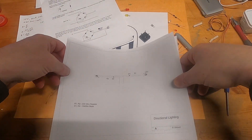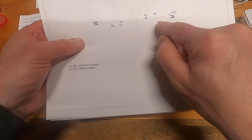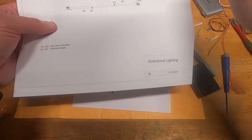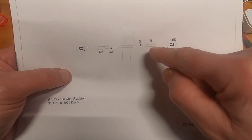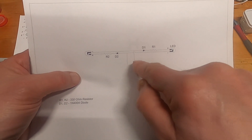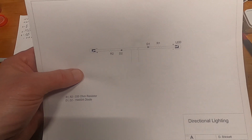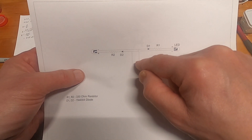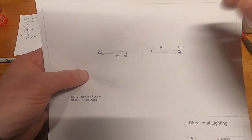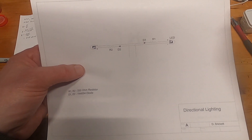One other thing I can show you is directional lighting. If you want an LED to light in just one direction, you can use basically just two diodes wired in like this, with a 300 to 600 ohm resistor. If the train is going this direction, this LED will light; if the train is going the other direction, that LED will light. I made up this wiring diagram for a GG1 — if you have a GG1, the lights change depending on which direction it goes. You can do that with LEDs in your GG1 just the same.